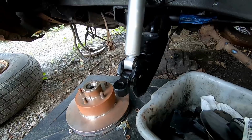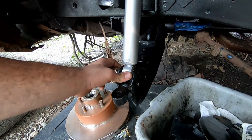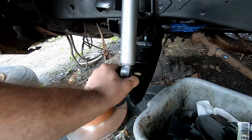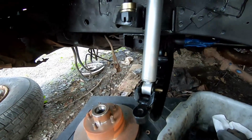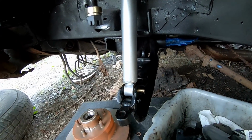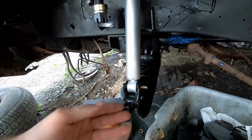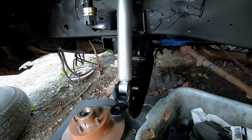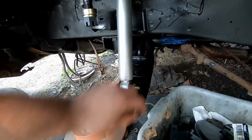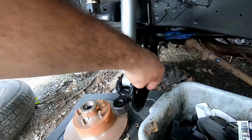Now, of course, these are right from my hardware store. You're gonna be really worried about shear strength. See, that is crazy big compared. So that's the problem with the hardware store. They kind of go from extremes, but you're looking at shear strength, not your tensile strength. So you don't need 8s, 10s, or anything like that. Just a bolt to do the job.